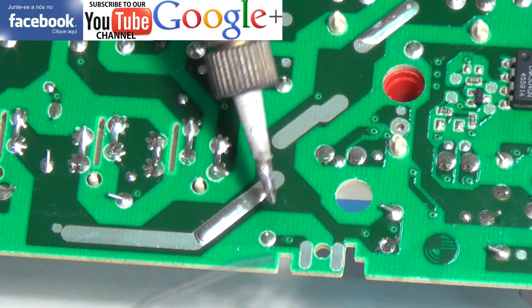It's well worth taking a look at the tutorial I've written at the website — it will give you an indication of what other components can fail on these circuit boards. They're not always repairable, but this E51 fault, after doing about 30 to 40 of these over the years, is a common fault on the circuit board. Also on some of the more upmarket machines with a digital display, sometimes the display goes down and you get no life to the machine at all, and it can be something as simple as a resistor. For the sake of a few pennies it's worth having it investigated.